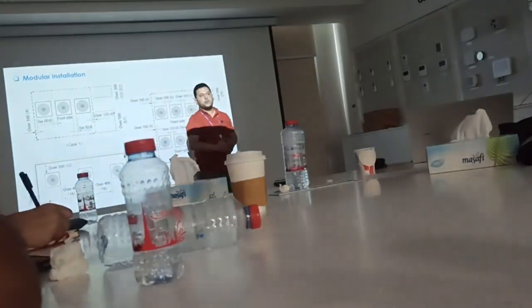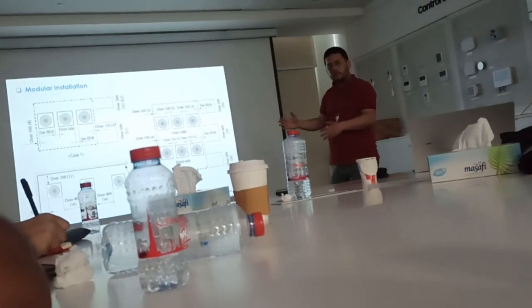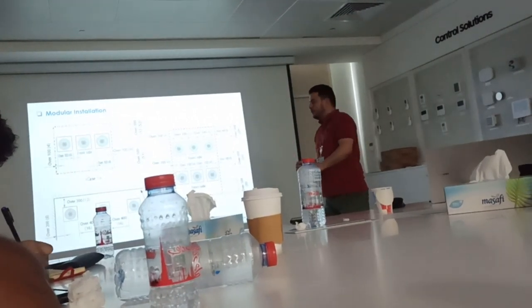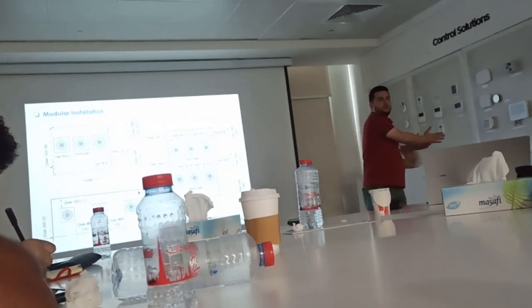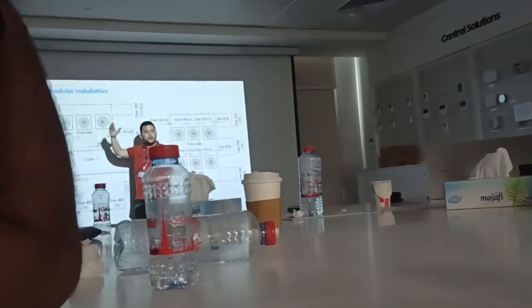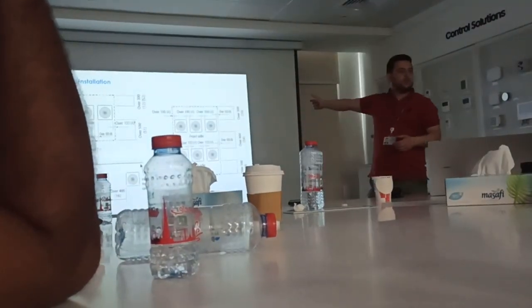very long wall, like you are fixing the units, you have a tower, a high building, and you are fixing the outdoor unit on the ground level, on the ground floor, not on the roof. So you are fixing at the side of the wall of the building, outside. That case will be unlimited wall height, we call it. We cannot consider 10 meters and 20 meters with that formula. Okay?